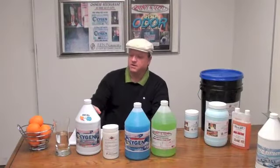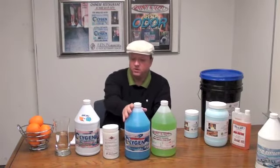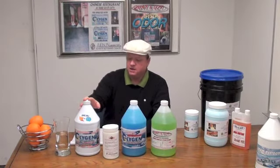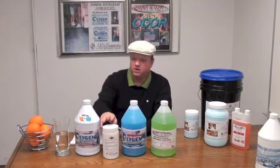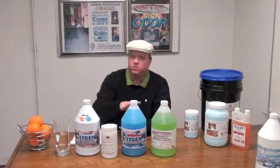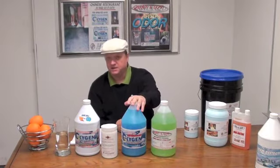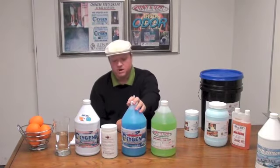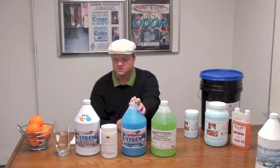So I just wanted to talk about the O2 system. If you've not used it, I think you would be real happy with it once you get the O2 system. Give me a call if you've got certain jobs, and I will talk to you about how to mix the hot sauce modifier and ratios with the O2 system, and put that fan down and see how fast you can get that carpet dry. Remember, the sooner we dry the carpet, we deal with that wicking issue, because once it dries, it can't make it to the surface of the fiber.